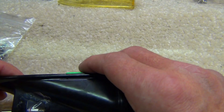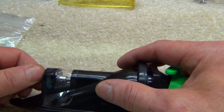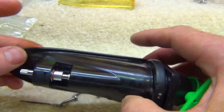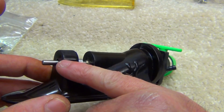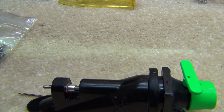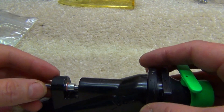As you can see, any water that comes up the stuffing tube generally accumulates in here, and once you've had your run you can turn it over and everything drops out. You may get a few dribbles through the bearings, but if you put some grease in there you can reduce that even more. If you want it super bone dry, add a little rubber gasket at the back — but what gets in the boat is negligible.